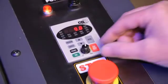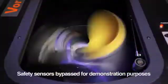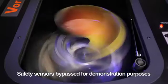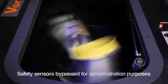The speed and duration are set on the Vortex Mixer's control panel and are determined by the viscosity, temperature and type of materials being mixed. Most materials will be fully blended and de-aerated in less than 30 seconds.